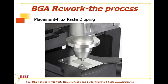Now the general camps, if you will, of BGA placement are flux-only attachment, which is the majority of the market. Thereby we have a device, a reballed or replacement device, that gets put into flux paste that is applied to the board. That is about 80% of the placements, at least in the United States, with the remainder being cases where solder paste is printed on the patterns, on the pads themselves on the board, and the BGA is placed into that solder paste.